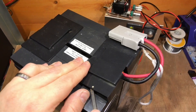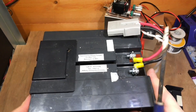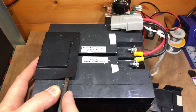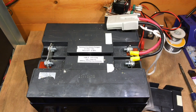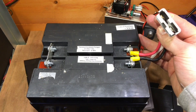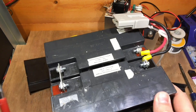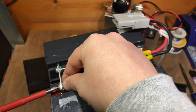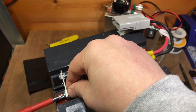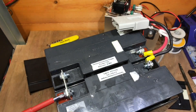Before I can test all these batteries I'm going to have to prise them apart. They have some protection covers stuck down with dual-sided foam tape, which should be fairly easy to get off. These are obviously connected in series because UPSs generally use a 24 volt system and use an Anderson connector to interconnect to the UPS itself. I should just be able to unscrew these — I don't expect they'll be particularly tight.